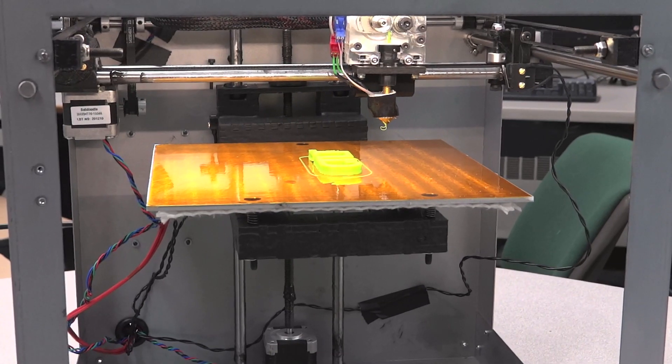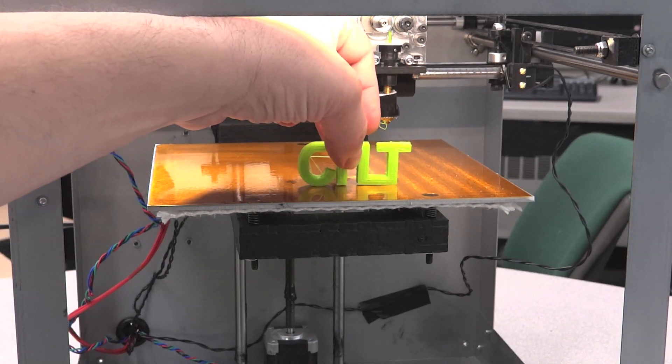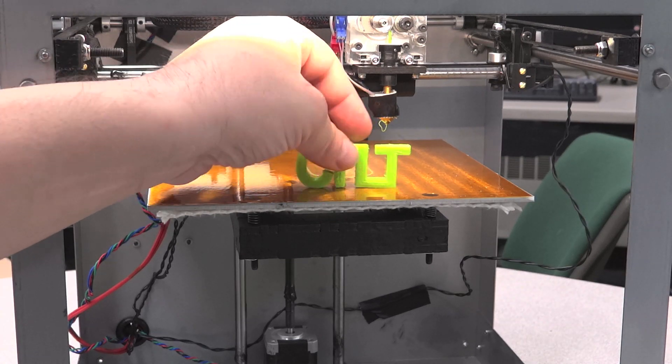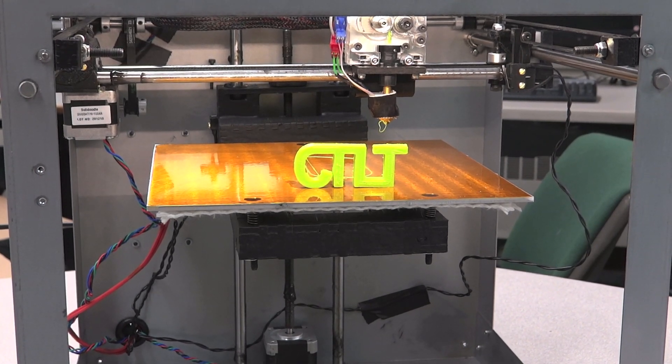The print job is finished. The piece snaps off pretty well. The bottom five or six layers are a little bit thicker than the others — that's a little odd to me — but nonetheless it did a pretty good job for the very first printing. I'll definitely have to follow up with fine-tuning. The surface looks a little bit bloated, so the filament setting and extrusion multiplier are things that might need to be edited. Thanks and have a great day.